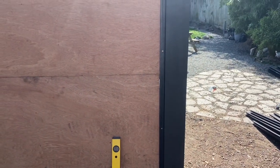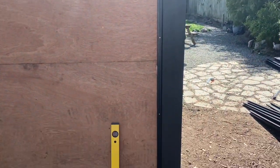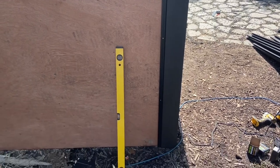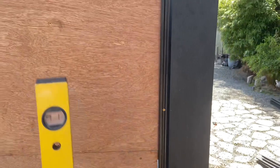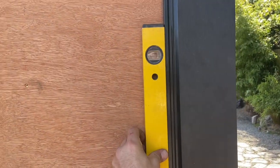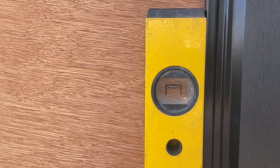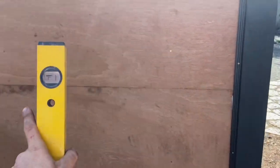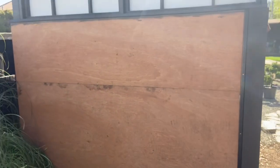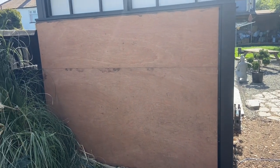Yeah, wood screws obviously, because we're going into the wood behind. So it's looking all nice. So I've got the first one on, and all I did as well, of course, you're just gonna get your leveler for the first one, and once you're dead center, screw it into place and bosh. Now you ain't going wonky or bent, just following the line all the way running down.